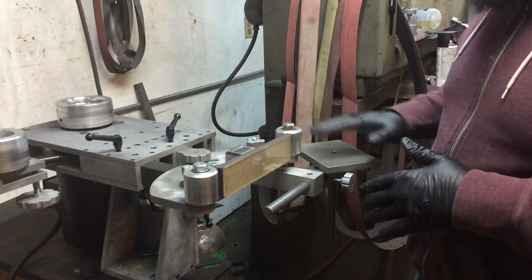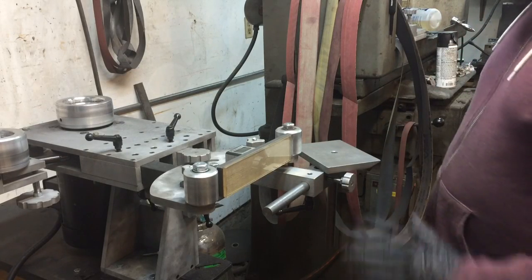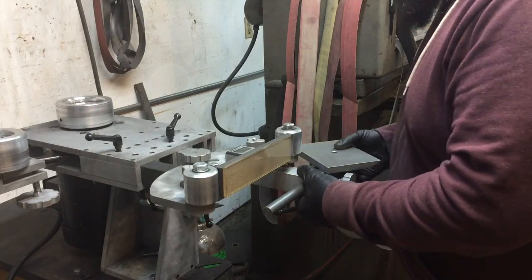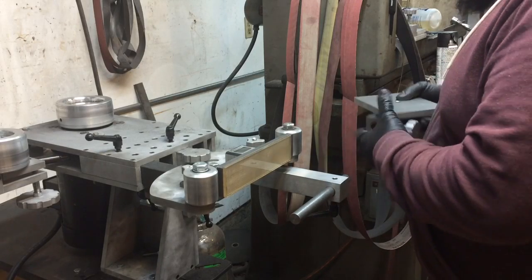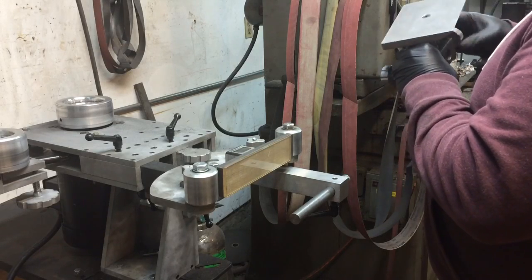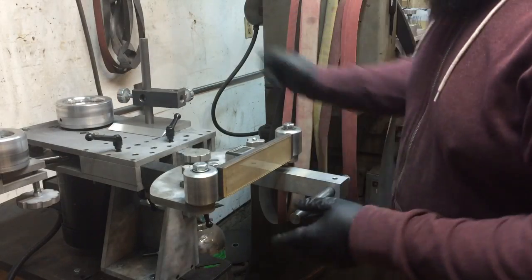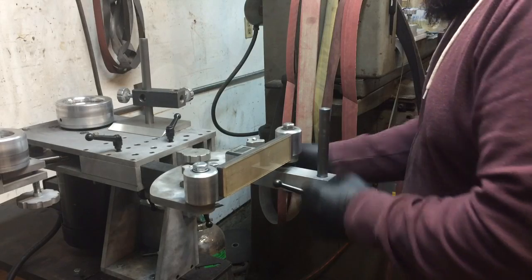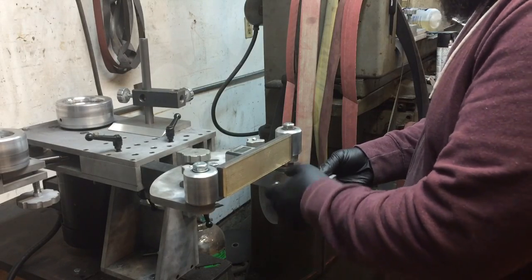You can move tool sockets if you want to get closer or farther away — just another versatility option. Now if you want to guarantee 90 degrees to the platen without using any angle gauges or getting too complex on your setup, that's very easy to do as well — pull this out, rotate 90 degrees, and flush that up.